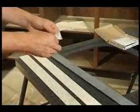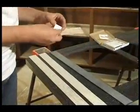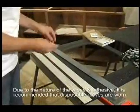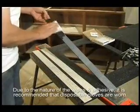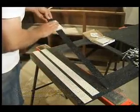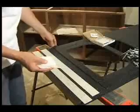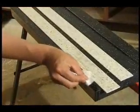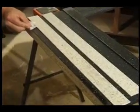To make sure there is no dirt or grease on the components being glued, clean them thoroughly. An isopropyl alcohol wipe is included in the pack for this purpose. The edging is already sanded to give a key for the adhesive. Make sure you use this side to put the glue on, and not the smoother side. Use the wipe to clean the cut edge of the worktop too.